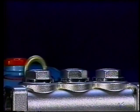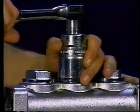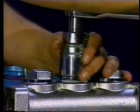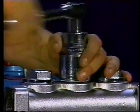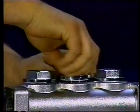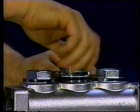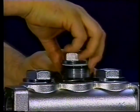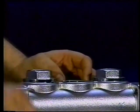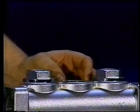To service the valve assemblies, the valve plugs must be removed. Use a 41 millimeter hex tool to loosen the plug, then unthread the plug by hand from the manifold chamber. 2 valve kits are necessary to do a complete inlet and discharge valve servicing. Both may not need servicing on the same schedule. Remove the exposed coil spring from the top of the spring retainer.